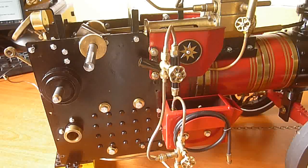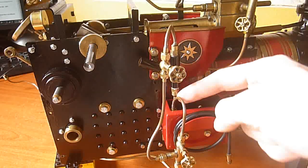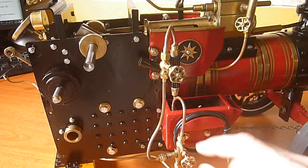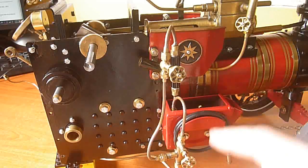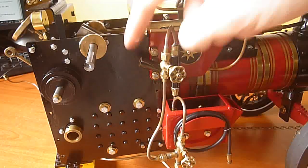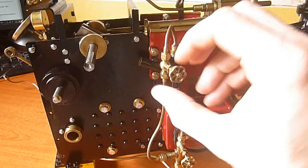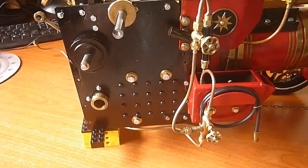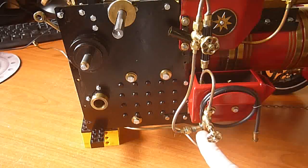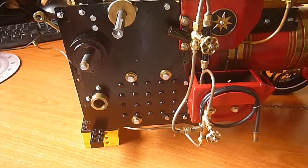Most of the hard work is done. I'll show you around the waterworks of the engine. Of course, this is the belly tank here. There's a manual pump inside that pumps water out this pipe, and you can open that valve to pump it into the boiler. This tube goes into the boiler, and there's a mechanical pump on the end of the crankshaft which drives the ram in there, pumping water out of the same belly tank up through — you can open this valve and it will pump water down that pipe into the boiler. That's the only way of getting water into the boiler.